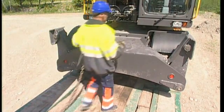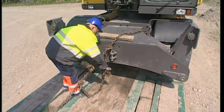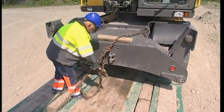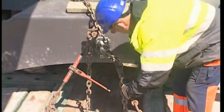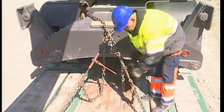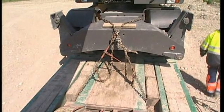If you have outriggers, a piece of wood should be used to protect the undercarriage from the chains. Always use the dedicated eyes for the chains. Depending on the type of undercarriage support you have — outriggers or blade combined, front or rear — different routing for the chains will be required. Make sure the chains do not cut into the tyres, as this will cause damage and should definitely be avoided.